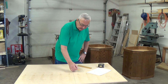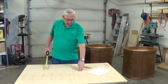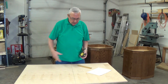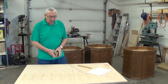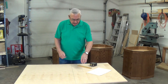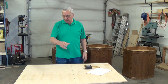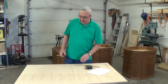So out of one sheet, you can cut your 4 sides. If you need 8, as in my case making 2 exactly the same size, you cut your sheets in 14-inch strips, 30 inches long — and there are your side pieces. Then from there, we've determined that the little angle corners are 8 and a half inches. In your remainder there will be some you can get from the last block, and then you'll have to go into another sheet. But you cut those 8 and a half inches by 30 inches long. We need 4 per unit and I have 2 units, so I need 8 of them.